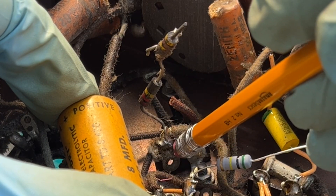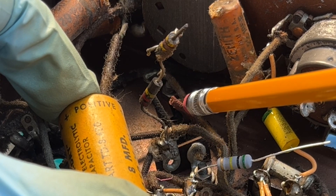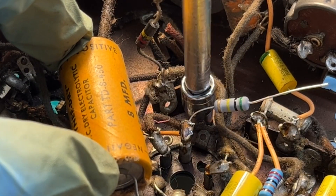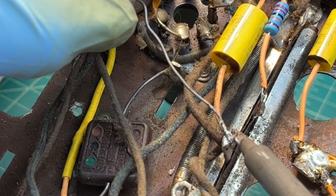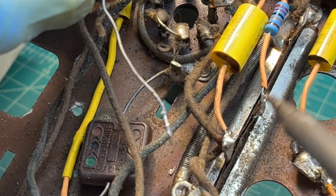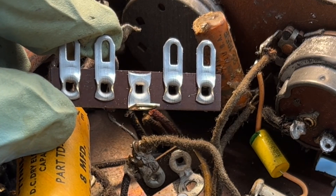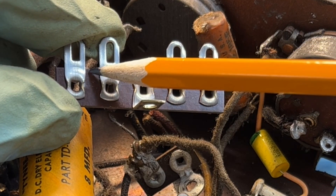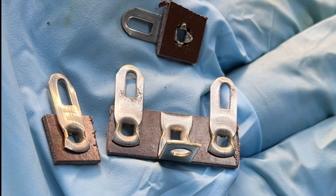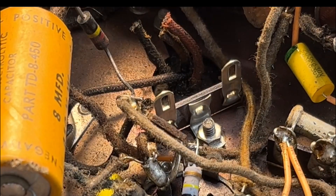There's a better look at the terminal strip configuration at this point. Just behind that you can see the on-top electrolytic can that's been bypassed. Get this electrolytic out of the way for now, the negative side tying back into the can dome at this point. I believe I've got room to mount this. I'm going to cut the terminal strip at this point here and this point here. I think I can squeeze that in there. There we go. Let me get the new capacitor put in place and the resistors tied in.